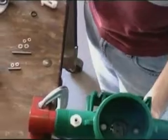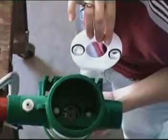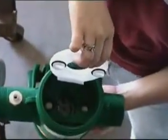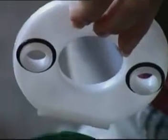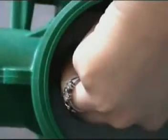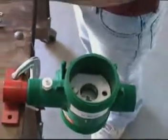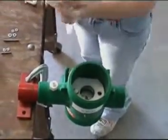Turn the body so that the bottom side is up and install the bottom valve seat plate into the body. Note that the exhaust side of the plate must be lined up with the outlet of the body. Install the exhaust valve sealing O-ring onto the exhaust valve. Push down on the valve seat plate so that the O-rings snap into the holes in the body and the plate does not rock. Install the motor cylinder and piston module into the main body.